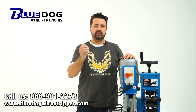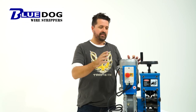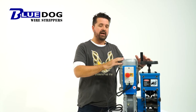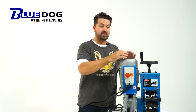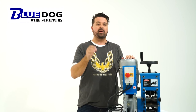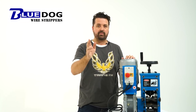If you're looking at processing Romex cable, I would not recommend going with a single-blade design machine such as the BWS60. This machine is okay if you go with quarter-inch and above — great machine — but if you're going with Romex cable, you're going to have a lot of adjusting of the blade up and down. And unless the Romex is perfectly straight, as you've seen in the video, it's going to wander under the blade. All single-blade machines on the market have the same limitation.